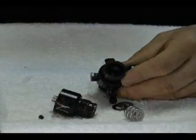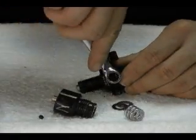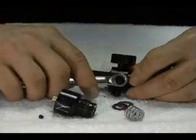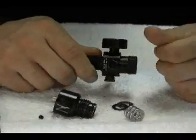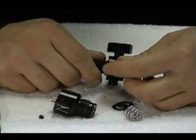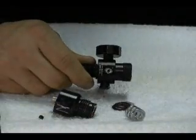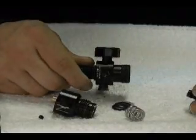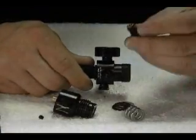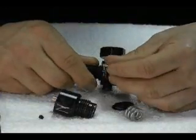Then, replace the low pressure burst disc. Simply remove the burst disc by turning it with a 3/8 Allen wrench in a counterclockwise direction. This is a normal right hand thread, just like any other bolt or screw. Once removed, dispose of the old burst disc and install a new burst disc of the same pressure rating. To install, simply screw it into the port.